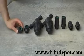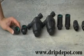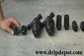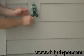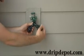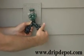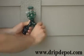The second item in the head assembly is the backflow preventer. You want to check and make sure that each backflow preventer has a green washer in it. The backflow preventer is then attached to the Y faucet connector, one on each side. Make sure you hand tighten the backflow preventer — do not over tighten.